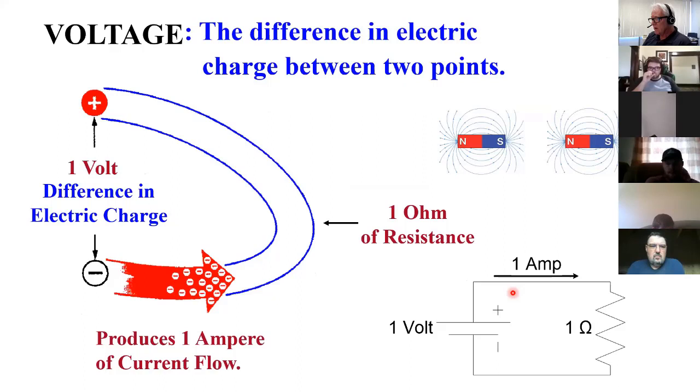Voltage is the difference in electric charge between two points. We said the difference in electric charge is because there are more electrons, which are negative in charge, in one place than there are in another place. So I've got more electrons down here than I have up here, and that's why this part is negative. And I don't know exactly, although I could find out, or so could you, how many more electrons I have to have down here to make this difference 1 volt of force. But whatever that is,